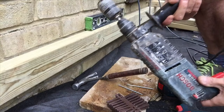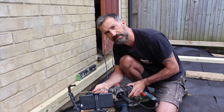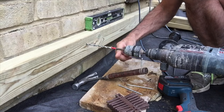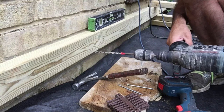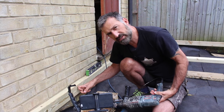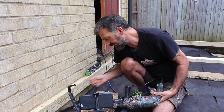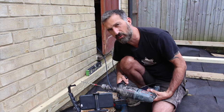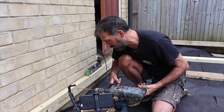Let's drill the hole – standard electric hammer drill with my bit in place. Offer it up, make sure we're nice and square both ways. You could go through the timber first with a wood bit and then switch to a masonry bit, but you'll find most builders just use the masonry bit on hammer mode all the way through.